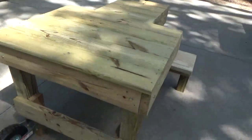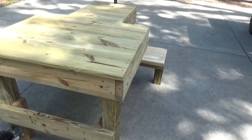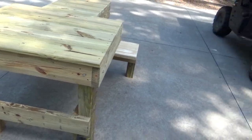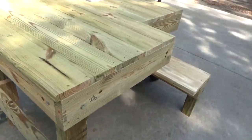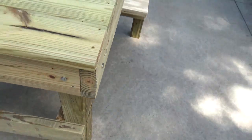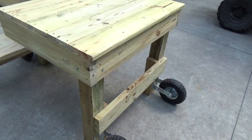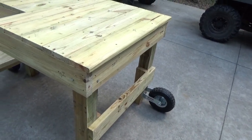Also, they wanted you to use, I think, 2.5 inch screws everywhere. I used 3 and 3.5 inch screws, and I used a really high quality powder coated deck screw. And even those, they were okay. So as you can see, I added some lag bolts into the 4x4s. On all the 4x4s, I ended up using lag bolts, and that really got them in strong. Plus they're glued, so when the glue's dry, they should be really strong.